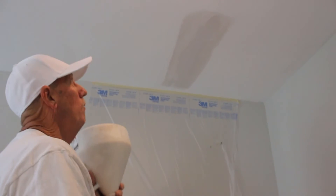Some people say you can just paint over it once it dries, thinking the roller will leave a texture — but it won't. It's going to be a big flat spot. So if you have orange peel texture, you need to either use a spray can or do the texture out of the hopper like we did here.